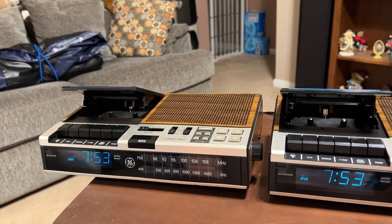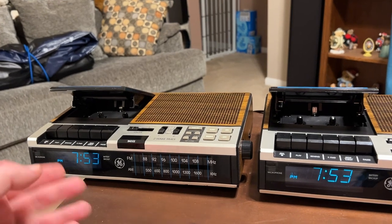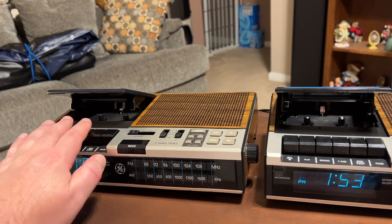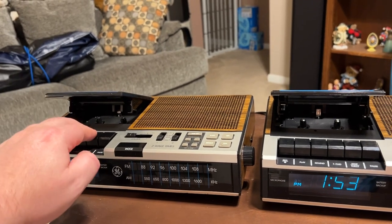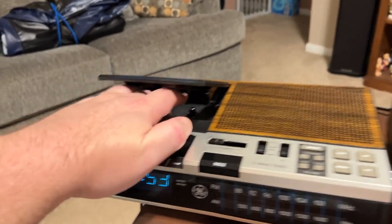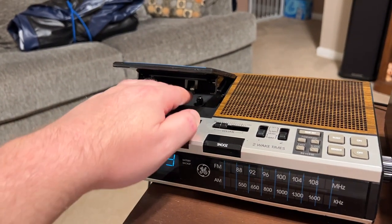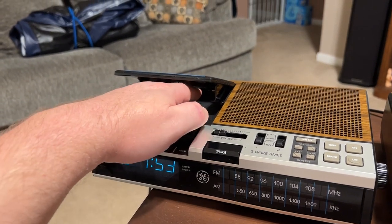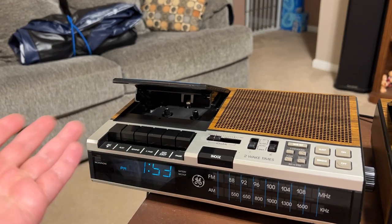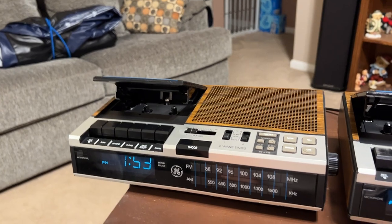Mainly that would be concerned for not driving the capstan flywheel, but you see transferring that up. This one here works different, as you'll see, but it requires another belt to drive the idler here in the middle of this one, and that has to transfer power to the other clutch, to the clutch on top of here, drive that. Sometimes it doesn't grab right because it's such a thin belt that this spindle doesn't turn, and hence your tape gets eaten.